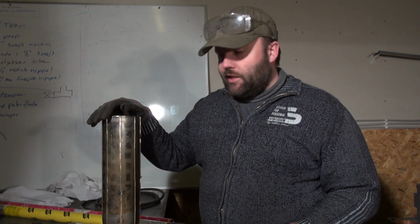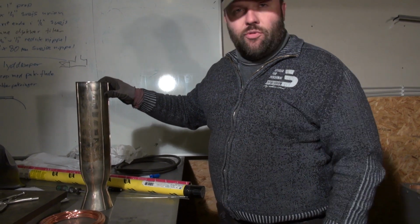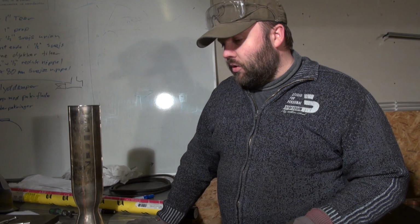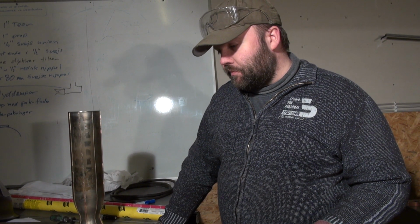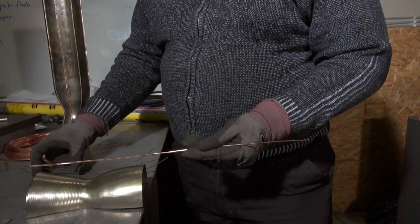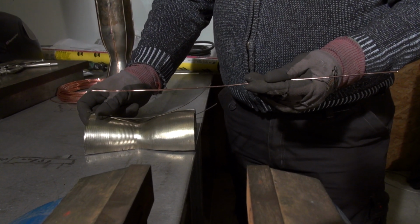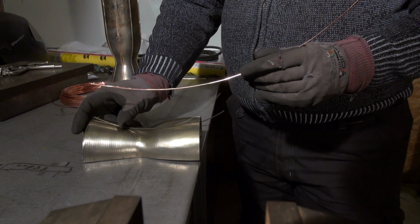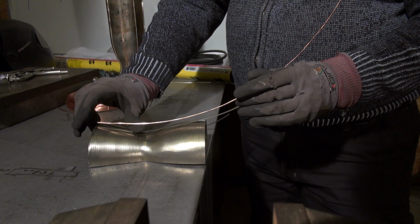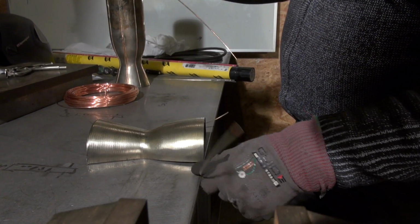So we've been experimenting a little bit in between and pioneered a new method which might make our future soldering work much, much easier. I'm just going to show you what this is about and what the breakthrough seemed to be. Now, what we learned from last time was that this copper spacer and this fantastic silver solder material in strip form could be sandwiched one upon the other. Still, you can see why this was rather difficult, with 8 strands of copper and 8 strands of silver solder and keeping everything in place at one time.